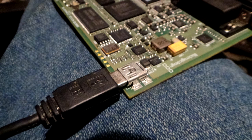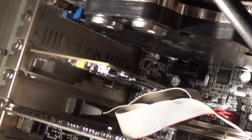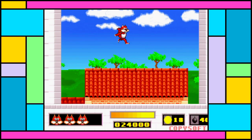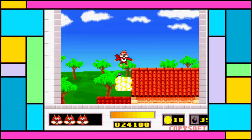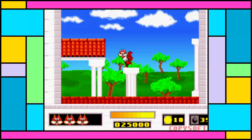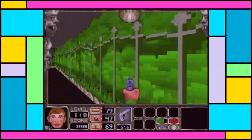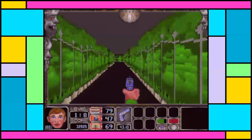I have no idea what the USB connector on the back of the card is for — USB Mini-B cables fit but I've never dared plug it in. One pro of using the Intensity Pro is that it records uncompressed video, so as long as your signal is good you get lossless quality, especially if you have a good enough drive array to handle the 10-bit modes. Unfortunately we won't be doing that anymore because of the AW8 Max being slower than hell on SATA. Also the inputs on the Intensity are a little bit crap — the slightest bit of noise and the signal is going to look terrible, and they're extremely sensitive to interference.